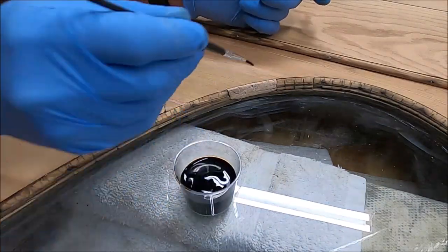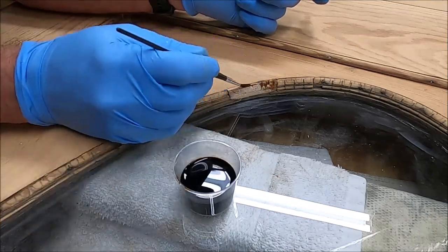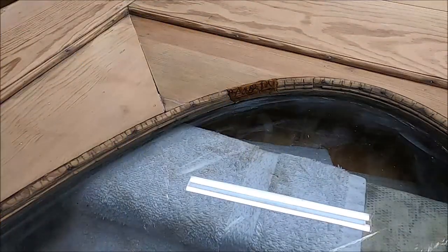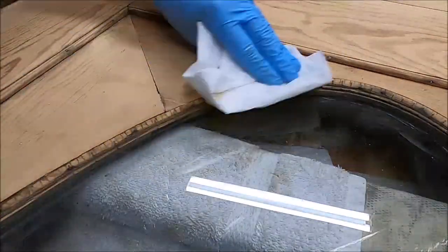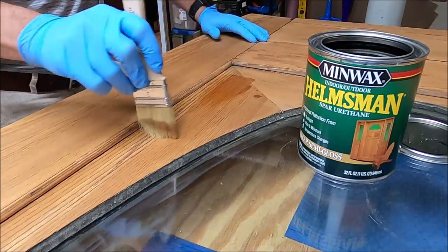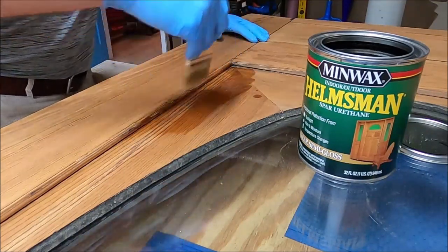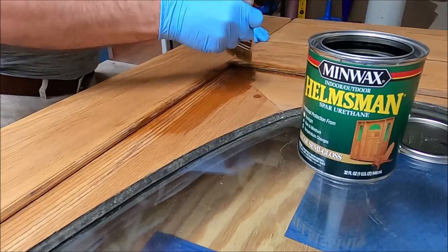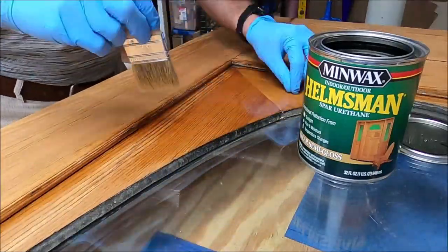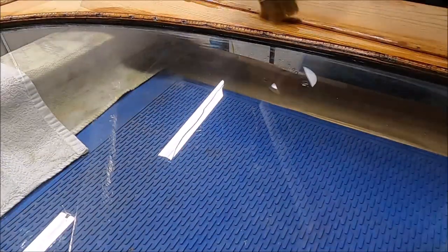Right now it just looks kind of like the wood filler, but I came back in with that stain I had put on earlier. Remember any end grain or any indentations you make will always be a little darker. I wiped off the excess and it matched up decent. Here's some polyurethane I hadn't used before and I like the look of it at the end of the day — I ended up doing three coats of this stuff so the outside is certainly more protective than it ever was.